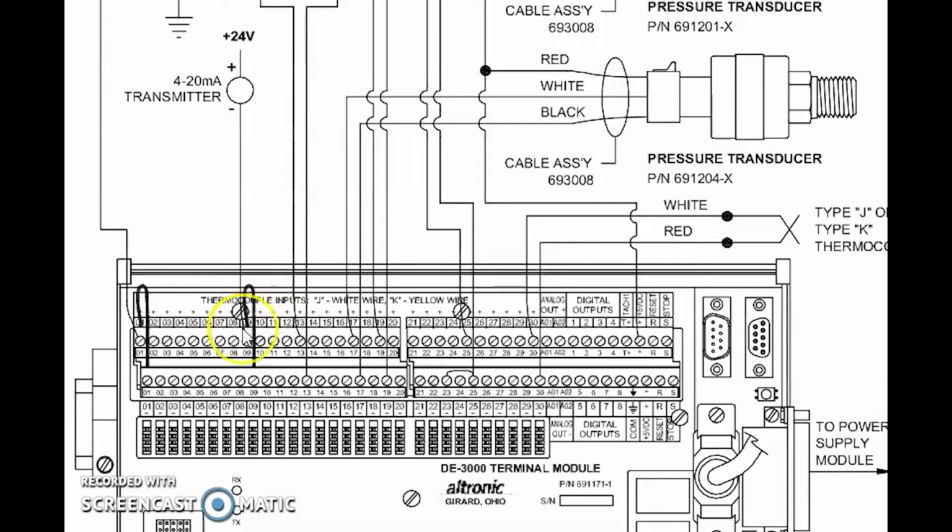So actually what we do, and this is true in any industrial product out on the market that measures 4 to 20 milliamp currents, they all convert it to voltage at the end of the day. So that's what this jumper wire is doing. We're taking the signal in 4 to 20 milliamps and landing it at terminal 9 in this drawing, and then we're jumping the two terminals together with a jumper wire, and internally this terminal is connected to ground with a 200 ohm resistor. So we're converting the signal from 4 to 20 milliamps to a 0.8 to 4 volt range. And that's really neat to know when you're doing some testing out on site, so you don't have to break your wire and actually measure the amperage. You can simply do a voltage test.